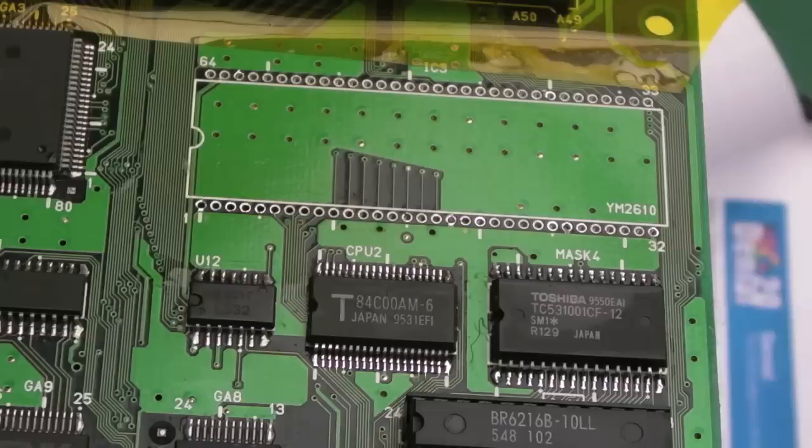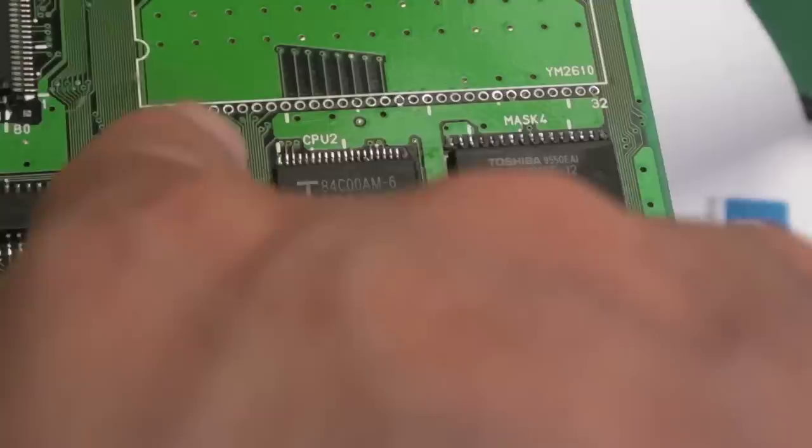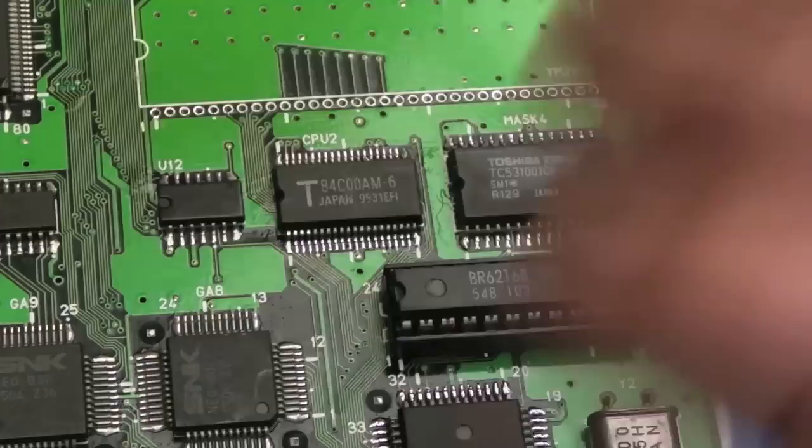So there we go, cleaned with cotton buds around there, super tidy. What I would say is you're still going to have the odd unblocked hole when you remove the chip that way. So I just did a similar thing. I used the hot air on, say this hole down here was blocked, hot air, 400 degrees, I got it pretty high actually, for 30 to 60 seconds, then swap over to the soldering iron and the normal desoldering pump, and you can unblock them super easy.